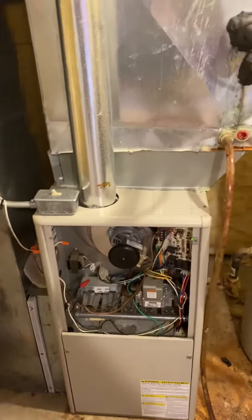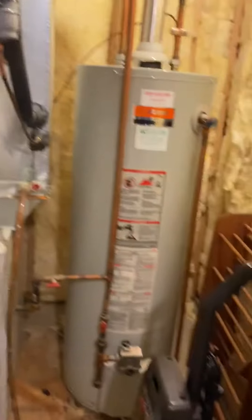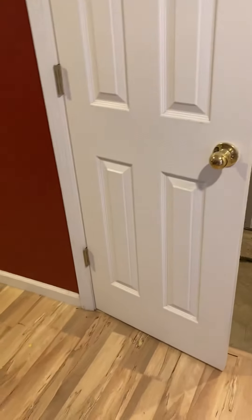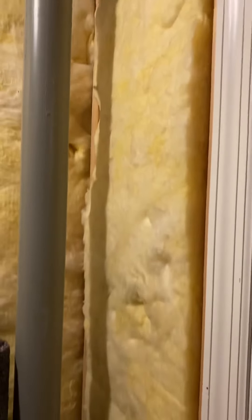Customer is also interested in a UV light — just tie that into the plenum right here. Drain is right down in front of the unit. Shut off the gas and electrical. We do not currently have combustion air, so we don't have any louver doors. Customer has requested that we put the high and low here on the right side — one down there, one up there.